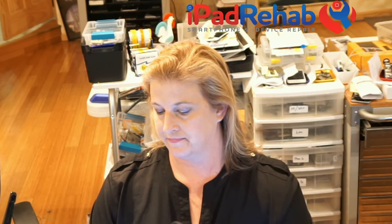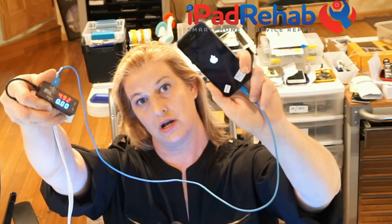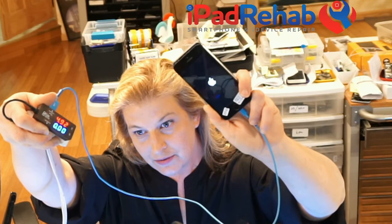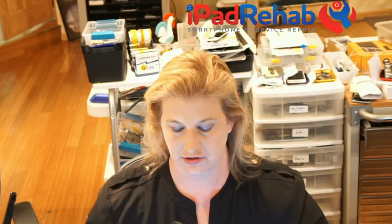All right, ready to test. Okay, so without the ACC power, we have zero current draw right now. Interesting. So 3v3 accessory power ball, D5 or D6, I forget. D, 1, 2, 3, 4, 5 is missing. Zero charging current. Let's see if it can actually boot. Now, it may have corrupted software from us trying to boot it without TriStar before, but that would be really interesting if it can't boot just because of that missing accessory line.